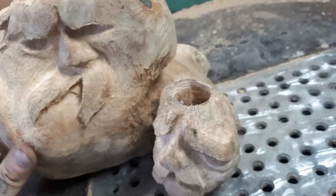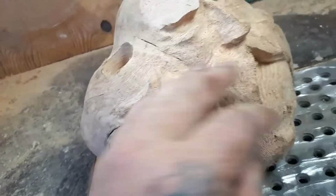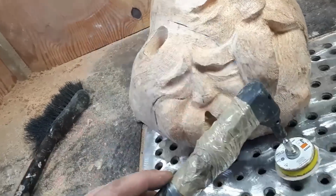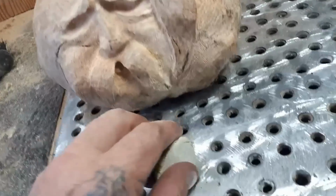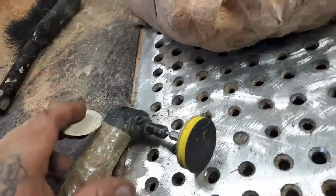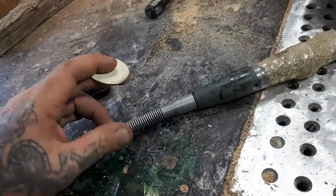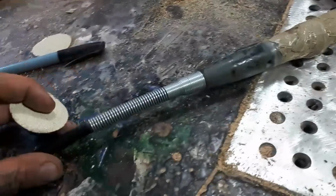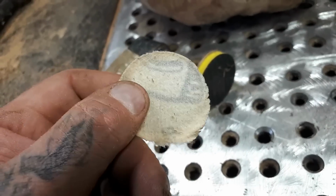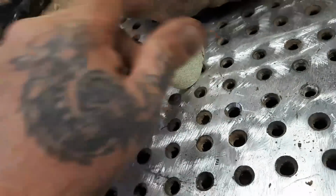So now my most favorite part to do is the friggin' sanding. And I'll be using this little thing hooked up to a Dremel foot pedal. I think it's hooked up to a Dremel 4000. These little Velcro hook and loop 2-inch pads with the 90 degree bit on the Dremel flex shaft. You can buy them on eBay, and you can use a 2-inch hole punch and punch them out yourself. So it just goes on there.